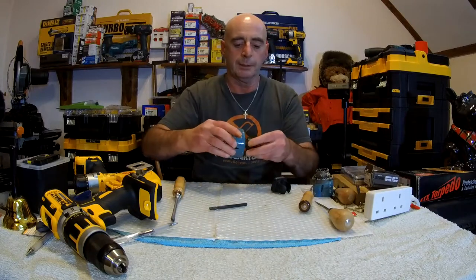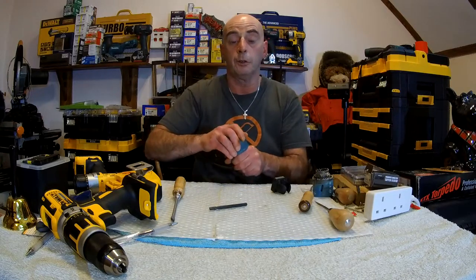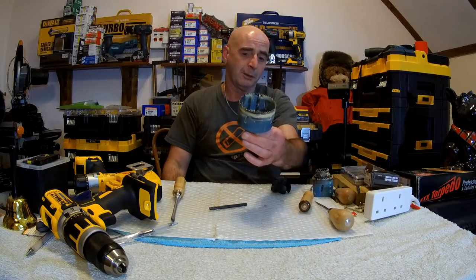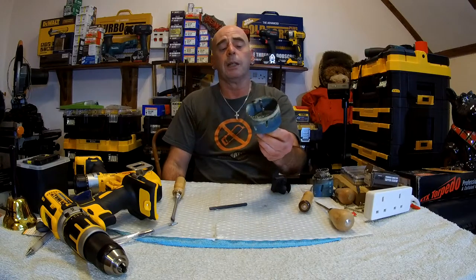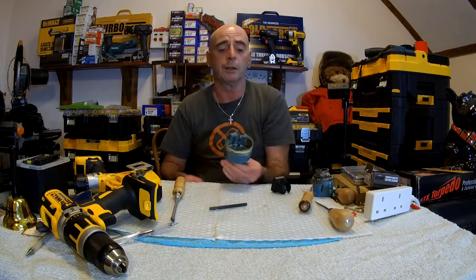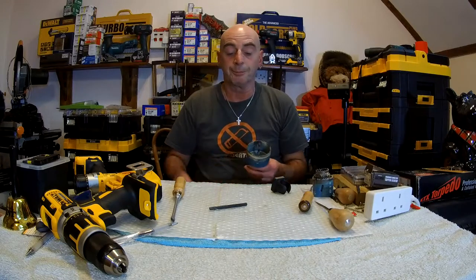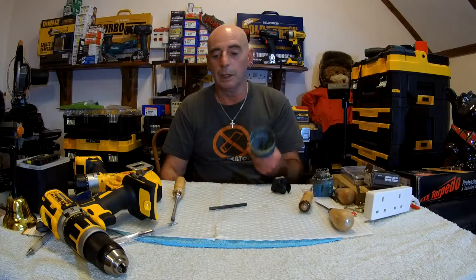This is why you should always try and get the correct size, and you should always check if you do break them - and you do break them from time to time. The way I do it is I go down so far, I make sure the drill bit comes through the bottom of the wood, I take it out, I turn the wood round, and I drill through again. That way it's easy to get the core out. It's an old trick. If you don't have the right size, you will start damaging the hole saw and you won't get a good hole.